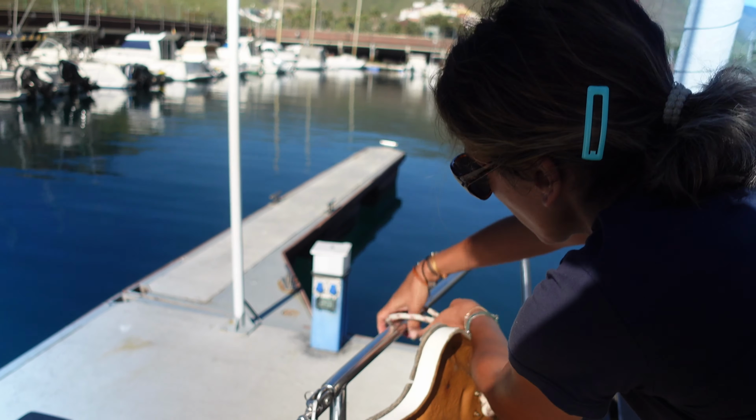We are now into our chain locker, where stands our two anchorage lines. We have the main one, which is tied up to the main 25 kilos FOB kind anchor, with 60 meters of chain and 30 meters of rope, which is quite long and perfect for Oriyo. And then we have another, it's kind of a safety one in case we have an issue with the main anchorage line. It comes with a kind of smaller anchor, but it's the same kind as this one. It's only 20 kilos with 30 meters, I think, 30 meters chain long plus some rope. And we keep both of them here.